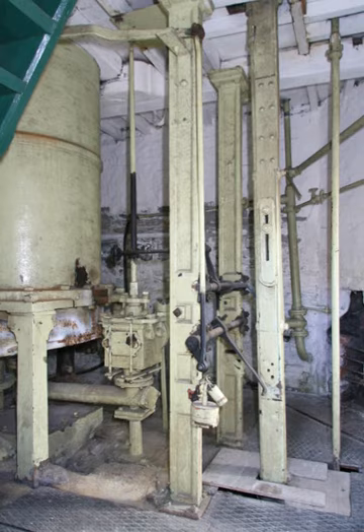The typical installation of a house-built beam engine spanned four floors. The cylinder and the engine driver's usual working position were located in the bottom chamber, approximately at ground level. Above this were the middle chamber, with the cylinder top cover and top nozzle, the upper valve chest, and above that the top chamber or beam chamber. The cataracts were located in the lowest part of the engine house, in a chamber below the bottom chamber, along with the exhaust pipe. This space was awkward to access and not visited in normal operation.